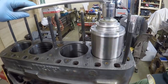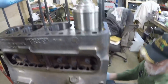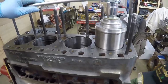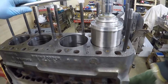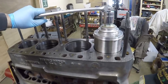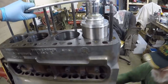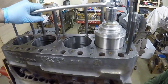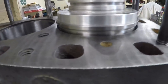Still can't believe that back in 2006 when I did my H, all four of those sleeves just pushed right in by hand — plunk, plunk, plunk, plunk — and it ran good, but I didn't know about all this honing and sizing stuff. Honestly, I like the way this is going in. To me this is about right — it's perfect. It's still going to be tight enough to hold itself in place so that if you put pistons in and have to crank it over without a head on it, they're not going to be pushed around.